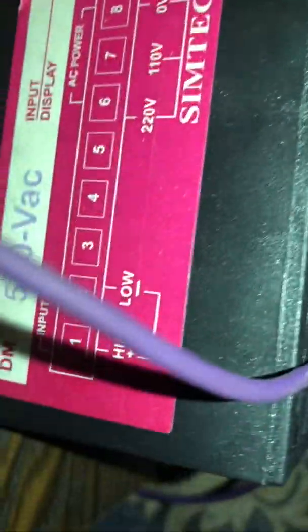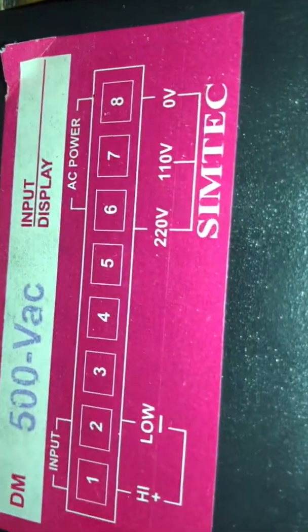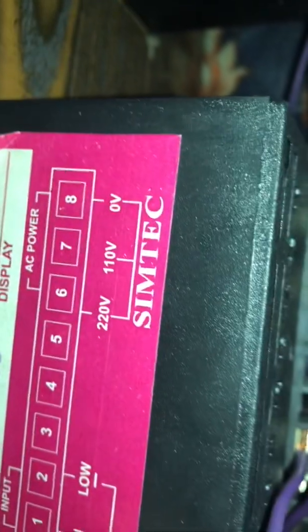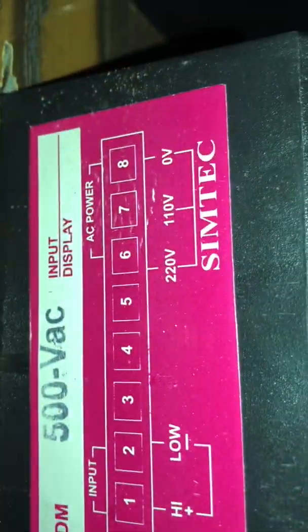Very simple thing — the wiring of these meters. The wiring given in the background is like this: plus, minus, low and high. At low and high you have to connect 440 volts. This will show you plus 2.2. First phase, second phase, and the second phase will jump here at number 6. Number 7 is blank. I have connected 3-in-line to show red, yellow and blue — all 3 phases. 440 volts are complete. This will help.